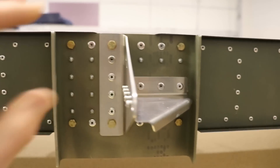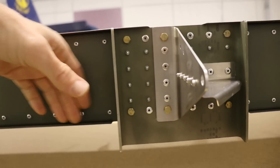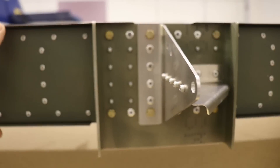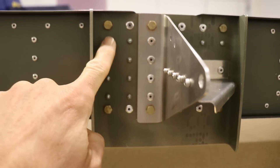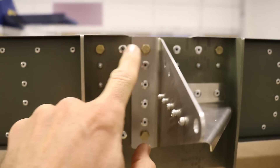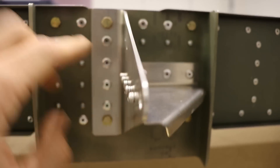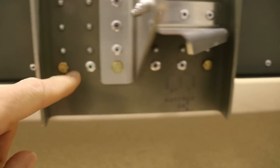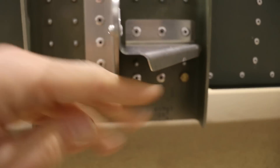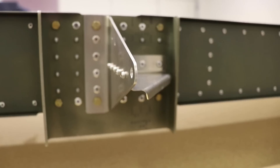The other thing I want to show you is this is the back center of the horizontal stabilizer. The elevator will attach up to the back of this, but this is technically the outside of the airplane, so you may be able to see all these bolts. What you really want to do — and this is very important — is make sure all the bolts are positioned the same way. They're not just all willy-nilly in there. On mine, the top surface on all six of these bolts goes horizontal, so they're all facing the exact same direction. Very important.